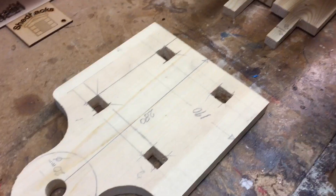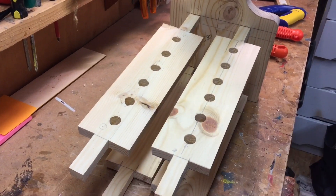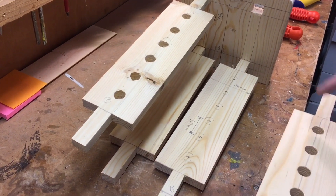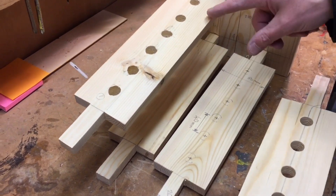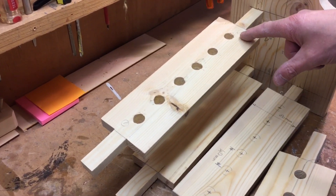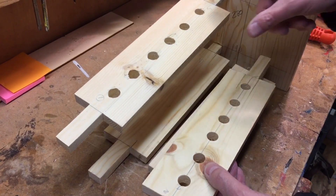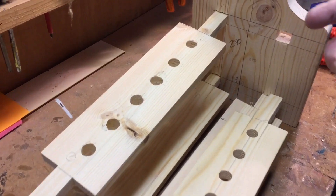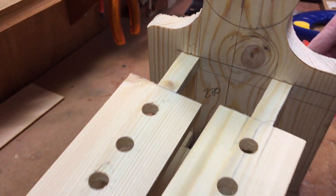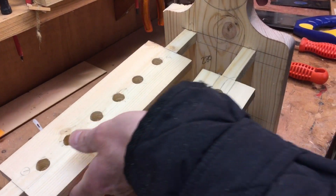Back to the storage project — we've got the four bat-shaped pieces of timber in there, all marked up so we know which way round they go. That's really important: number them — one and one, two and two, three and three — so as you work you know where they all go. You can see that mortise and tenon joint works really well, but on some of them they're quite stiff.